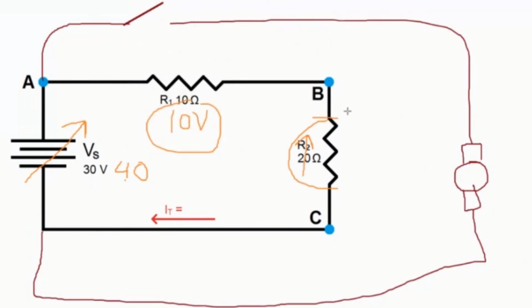So what I'm going to do is put a pressure or a voltage compensated resistor in here. And it's going to constantly study the pressure on either side. If the pressure goes low here for whatever reason, it's going to make this a greater resistor, more or less, to make sure that the flow rate through here is consistent all the time. No matter what this is, this could be 30 volts, 100 volts, 62 volts, whatever it is. If I want this to always have 10 volts, I have to ensure that the same flow rate goes through here all the time. That means the voltage drop across it is going to be the same and the power in it is going to be the same.